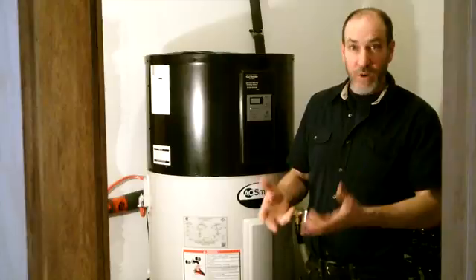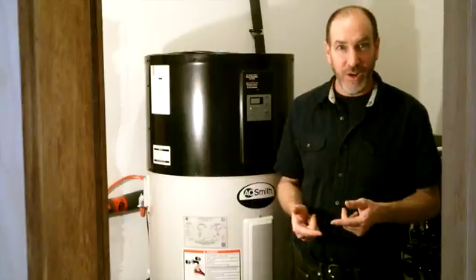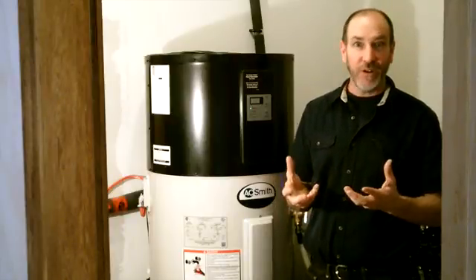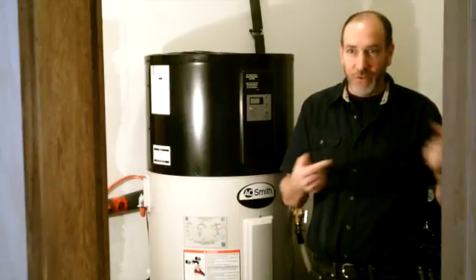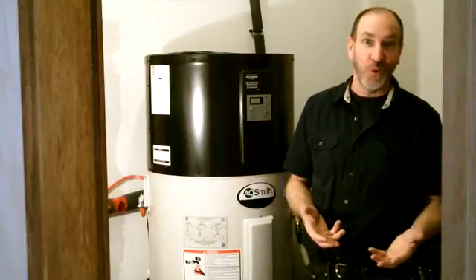The real benefit actually comes in the summertime. Think of what it's doing: it's taking in the heat from the ambient air, generating hot water, and spitting out cold. So this thing just turned into an air conditioner in the hottest room of the house. Normal air conditioners condense the heat and expel it from your house, so you and your neighbors are having a war blowing hot air at each other. This air conditioner is just giving you your hot water. So you can look at it like you're getting either free hot water for the summer or free air conditioning — one or the other.